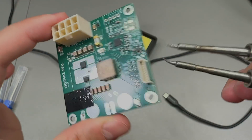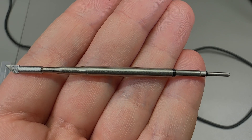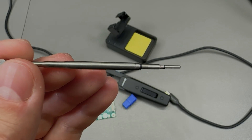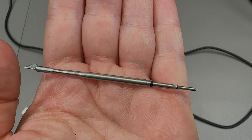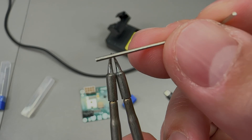0402 is doable — this is actually a board I've been working on with 0402 components and I've been using the tweezers on it. The tips are of integrated cartridge type and are a clone of the JBC C210 model. If you already own C210 tips from JBC, they will be compatible with these tweezers.